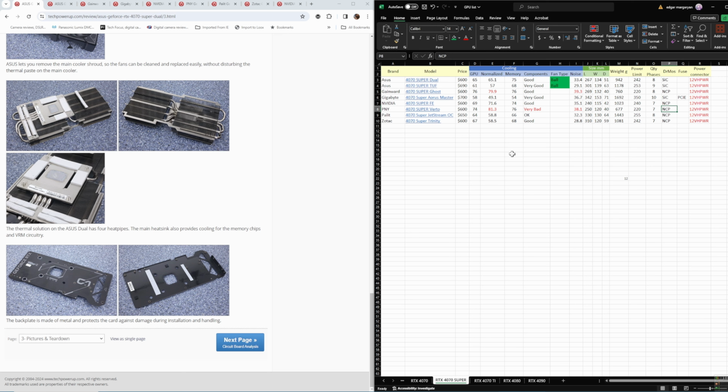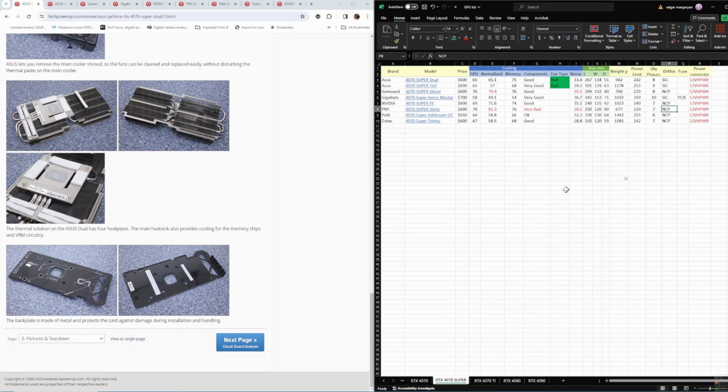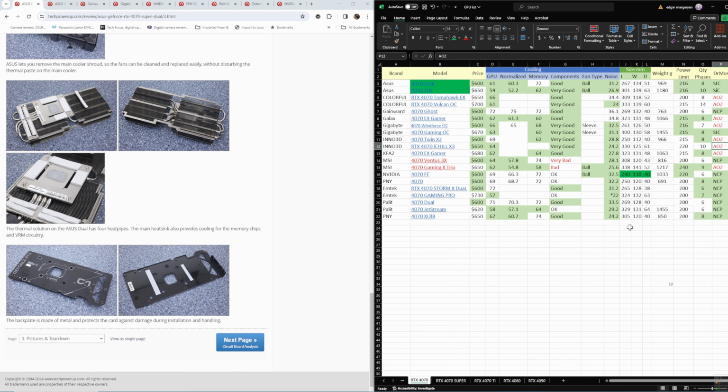Unfortunately, all manufacturers decided to skip the Alpha Omega VRM chips, which, for example, if we look at the 4070, there were plenty of them. But recently, especially these VRM chips in 3090s started to blow at a much higher rate. I guess they understand that they're not good quality components, and everybody is now using the average ones, not the top ones.